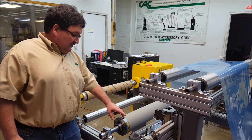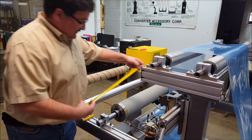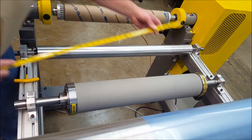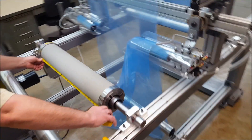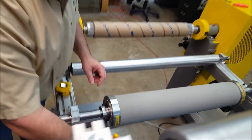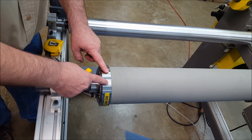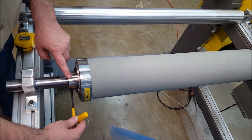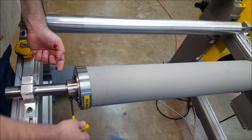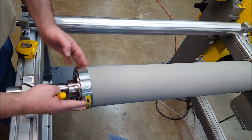What we do is we angle this collar. Right now, if you were to take a tape measure and measure this roll's face, the roll face on this side is about 27 and a quarter inches. If you measure the roll face on the other side, you'll see that dimension is about the same — about 27 and a quarter inches. So what we do is we take this collar — this is the adjustable bearing ring — and that's mounted on an axle with a bearing that holds up this collar. We're going to adjust this screw, and you'll see that collar tilt in on this side and tilt out on the other side. As I screw down on this adjustment screw, this adjustable bearing ring is tilting, and that tilts the whole collar assembly. Then I'm going to do the same thing on the other side.